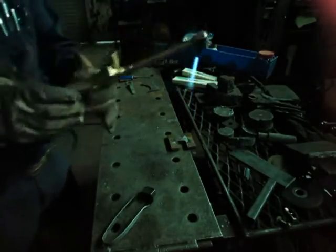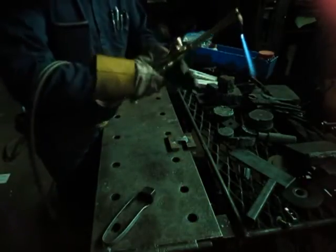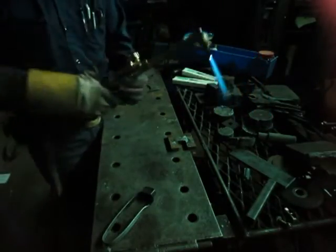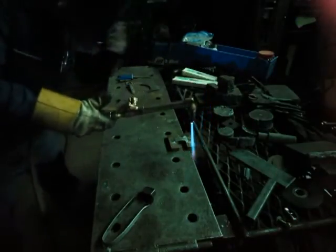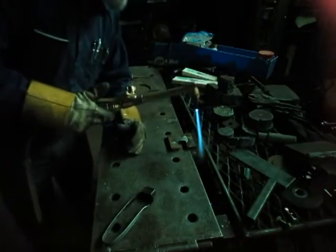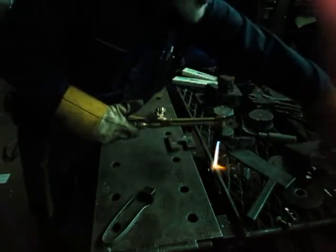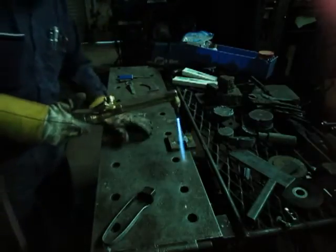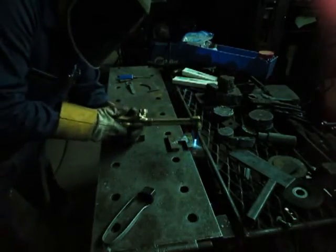Got 40 psi oxygen. One thing — a little trick — you can loop your hose over your arm if it's going to catch on something, or if it's not, it's more comfortable and you've got more freedom of movement this way. There was a discussion about having a shim under your hand to get it at the same level or even a little higher. One of the reasons I have so much stuff on this table is just for that — just to have something to rest your hand on.